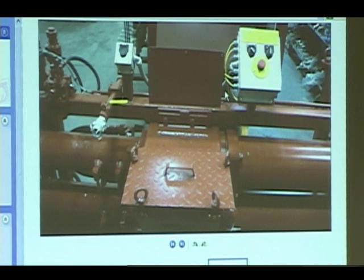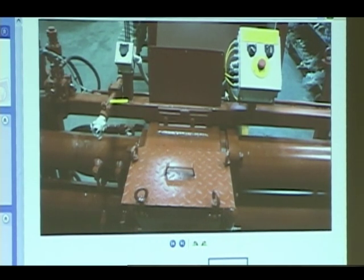There's a direct rollover. Now, what they're going to tie that into, right now the only thing that's coming to me is the permissive. What I have to have to run is the valve train has to be lined up to the incinerator, and the incinerator's got to tell me it's okay to pump to it. Do they have to be reset through SCADA or on your screen before it'll start up? On my screen. If you reset on SCADA, it'll reset mine, I believe. I haven't tested that. Not too sure on that.